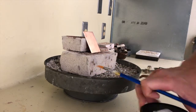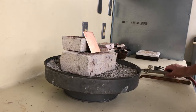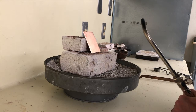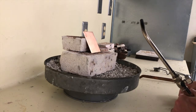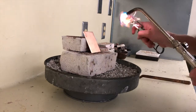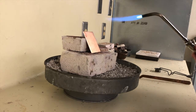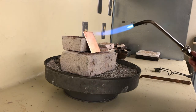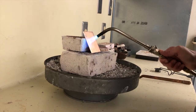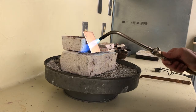That's probably roughly 1200 degrees Fahrenheit, somewhere in there. I can still do the rainbow technique, but the tricky thing is that the rainbow and dark color stages are harder to see in brass, and even harder in nickel silver. So it's nice to have another option. I put the flux on the back of the piece — the part I already sanded — because once I pickle it and clean it, it will create some discoloring and I don't want to have to sand that again.